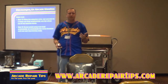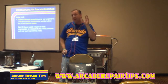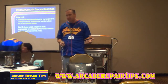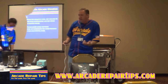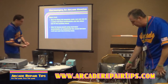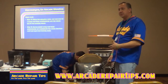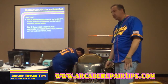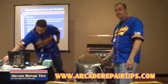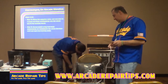Now, you guys got to remember, I didn't go to formal electronic school for this, and I know that somebody on my YouTube page is screaming at me right now, that's not the only place that can pop you. And they are correct. Your larger capacitors can do that. I'm real simple: I remember my first time, I'm taking the screwdriver, touching this heat sink, touching anywhere possible, and that's not a bad idea. But most of the time, if you pop that, this will discharge pretty fast, or this will nowhere near hold the capacitance of the pop that does. But these large capacitors can hold a charge. Most of the time, just do that and you'll be fine.